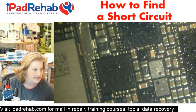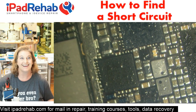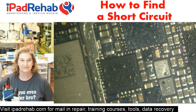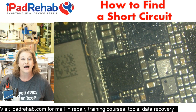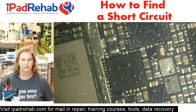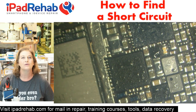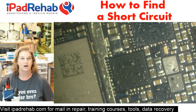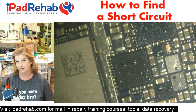All right, now here's the thing. Does that mean we know what line is short? We still don't know. The PMIC is not a circuit. It's a chip with lots of circuits. So how do we figure out which line is short? A lot of people will be like, PMIC gets hot, take off the PMIC. We don't know that the PMIC is the cause of the short. We have to find out what line is shorted, and we still don't know.